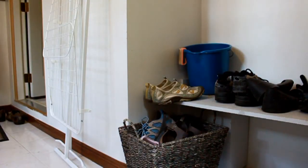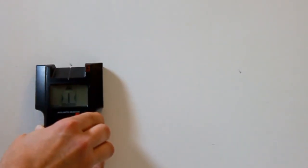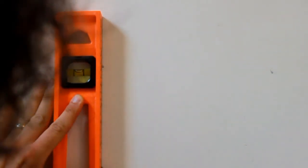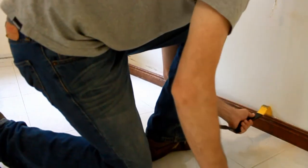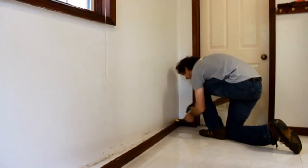She got this idea from Pinterest to do horizontal wainscoting. So I grab my stud finder and mark all the studs using a level and a pencil. I bought some 8-foot pine plank paneling and aired it out overnight. My hammer and pry bar sure came in handy for pulling off the crappy old baseboards that I shouldn't have bothered saving.